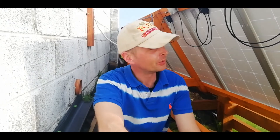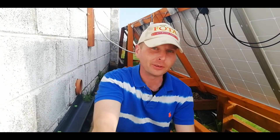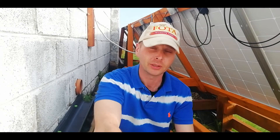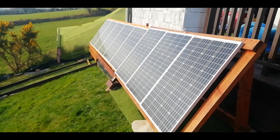The PV input has to be a minimum of 120 volts. So I've just finished rewiring all eight panels into a single string, which brings me up to about 140 volts - just to get within the threshold. Gone back up to the inverter and everything's working perfectly. Thanks to James and his lovely partner Serena - it was lovely to meet you both, and thanks for the eggs too, absolutely delicious. Every day is a school day - next time, read the specs!